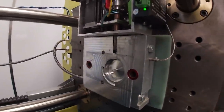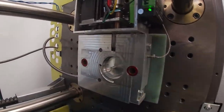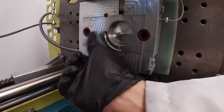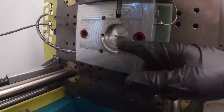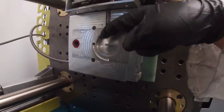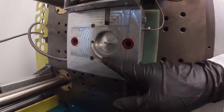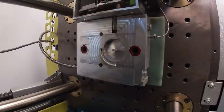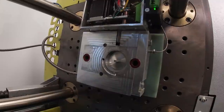Then the mold will close on this cavity with the two core features extended inside, squirt plastic in through this sprue right here, and then the runner will bring the plastic around and through the gate, which is right there, and fill this mold up with plastic. I put the gate down here because it's going to be opposite of the steel pin, which is not really supported well on the end. So I wanted the plastic to fill in line with the pin so it didn't push the pin off one side or the other.